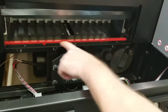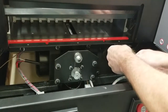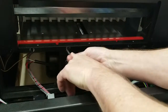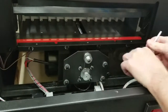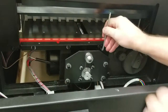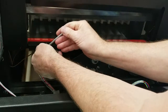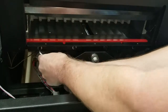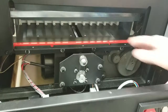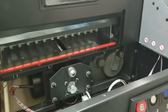Get it back in there and hopefully the bar did not move. Make sure it's all the way down and just tighten these back up — snug them tight, fairly snug. You can crank down these a little bit, especially since the Allen wrench doesn't give you a lot of leverage anyway. Just make sure it doesn't move. If one did move, you can always put a spacer in there somewhere, but typically they clamp down pretty good so you shouldn't have that problem.